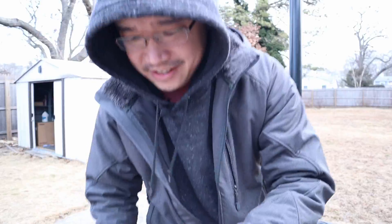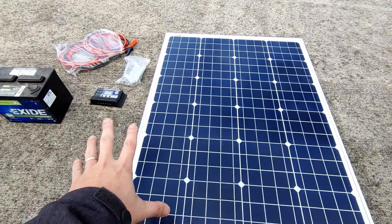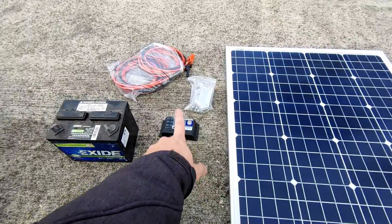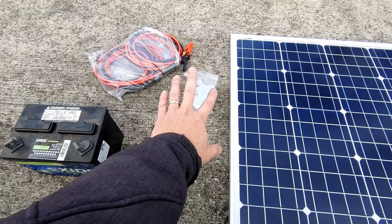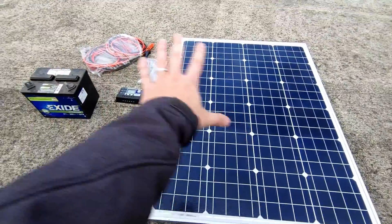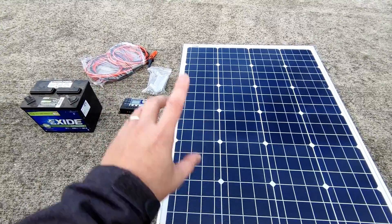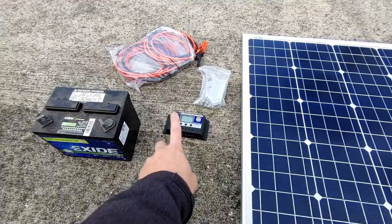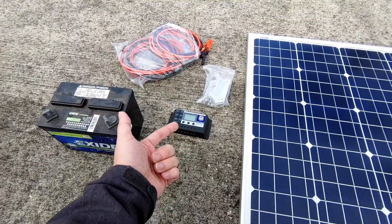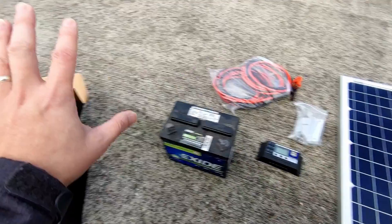I did a little bit of research on this, which makes me basically an expert compared to people who've done zero research. What I got is a solar kit setup from Amazon — a 100-watt panel that comes with a PWM solar charger, some hardware, and cables, plus a battery I had left over. I played around with this setup and got everything working, but you quickly realize that PWM chargers are not the way to go. Everyone says to upgrade to MPPT because you get the most efficiency out of it, so that's what I ended up doing.